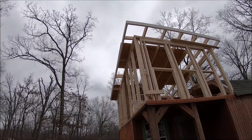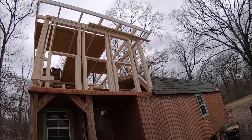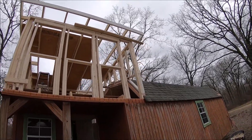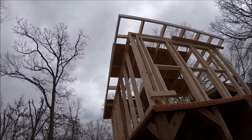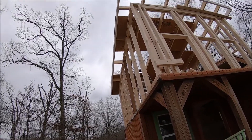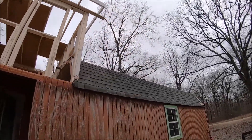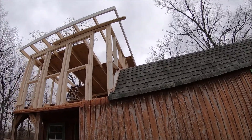Got some beautiful overhangs. We're using the old decking that came off the roof. I think we may have enough. We have a couple scrap pieces around here and then we're going to put the metal on. You can see on this end I cut four 2x6's and put them in to support that outside fascia board. So that's looking really good. We still got to move some stuff around and screw it up there. I haven't done it over here yet, but we're coming along.